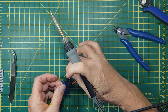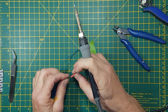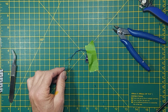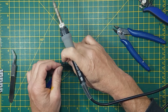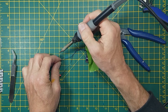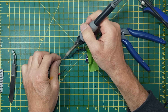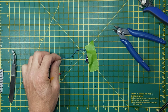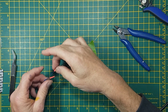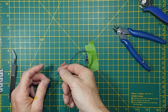Solid joint. Heat shrink is ready to put down — I'll do that later. Now the same with the blue wire, or a slightly purple wire in this case. Same again. Put the wires alongside each other and just a tiny bit of solder onto the joint. We'll now slide the heat shrink down to insulate it, like so.